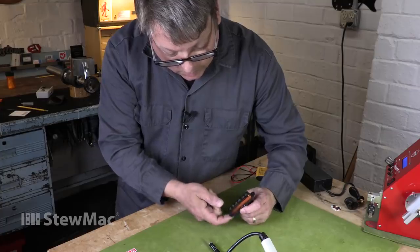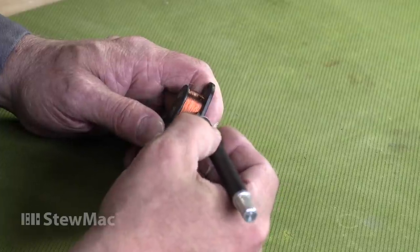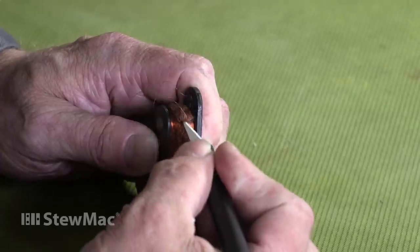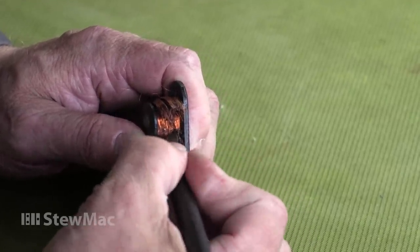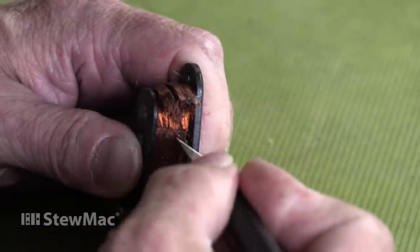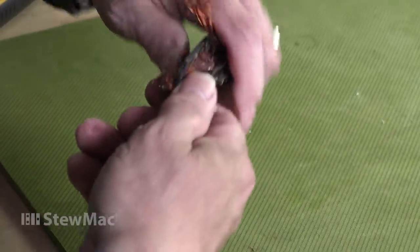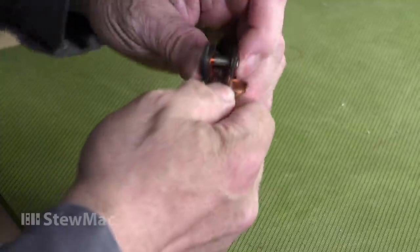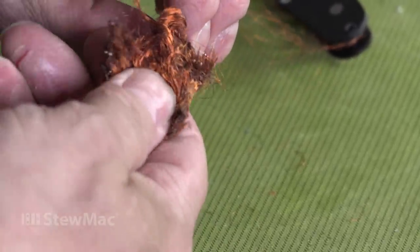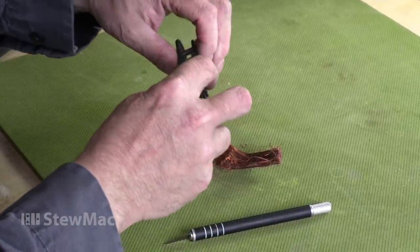I'm going to go ahead and cut the wire off. I really hate to do it — beautiful old formvar wire — but there's clearly an internal problem here. I'm going to insert my knife at the bottom of the coil, in between the E and B pole pieces, because I'm still kind of convinced they might be part of the problem. You cut toward the center because you really don't want to catch the flatwork or the coil wire during the rewind, so carefully cut inward slowly. Nothing too weird or obvious going on in there — no corrosion. So it must have just been the insulation breaking down and causing the wires to short into themselves.